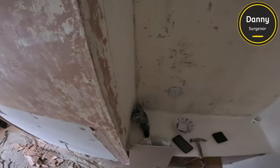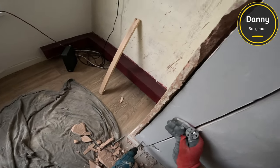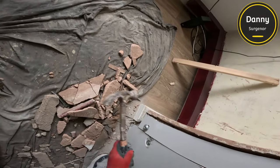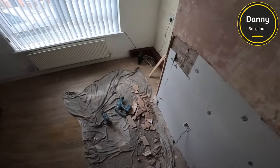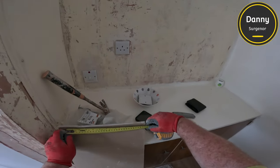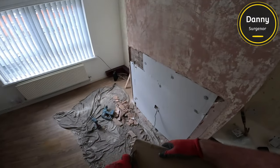You can see here we're just using our tape measure and knife to cut this board. I find it easier to cut board using the tape as both a measure and mark at the same time. I always find it easier that way than using one of the T-bars for cutting plasterboard — I'd only use that if I was plasterboarding lots of stuff in a house. We'll cut this little bit flush and then fix the next bit of board on.